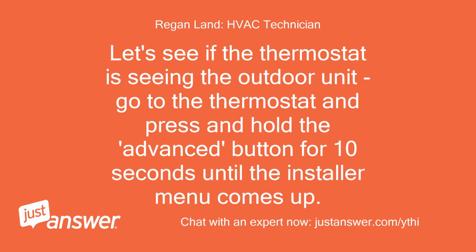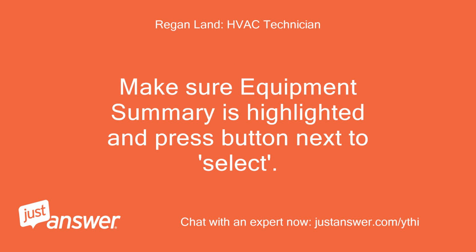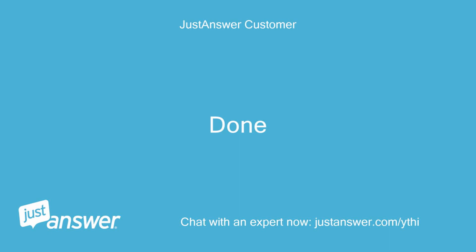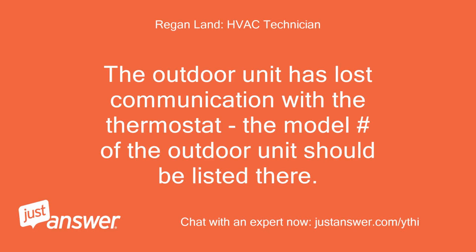Go to the thermostat and press and hold the advanced button for 10 seconds until the installer menu comes up. Make sure equipment summary is highlighted and press the button next to select. Take a photo of that screen and post it. Done. The outdoor unit has lost communication with the thermostat. The model number of the outdoor unit should be listed there.